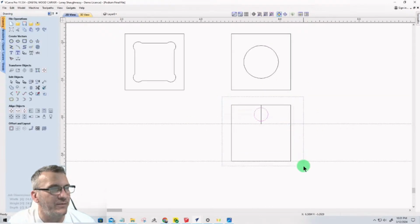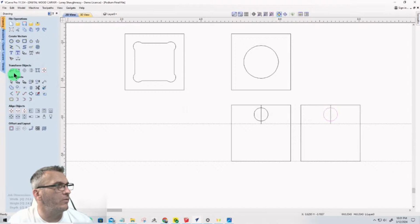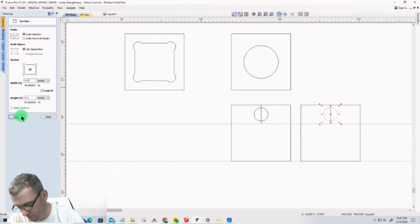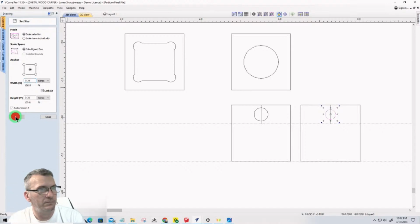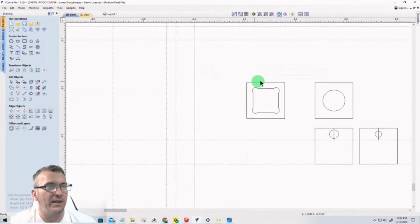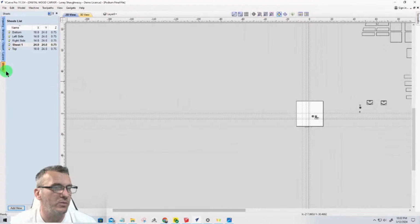I will add a second vector here, a fourth vector here for y'all's file that I put out to you. One will be with the hole for the threaded insert, and one will just be with an oversized hole for your 1/4-20 bolt to pass through. Either one, and I'll create tool paths for both. But now that we have them laid out, that's our vectors for the tool path. Now let's go set up the sheet, and then we got to wrap it up because we can't go much longer. So this might have to go into a third one.